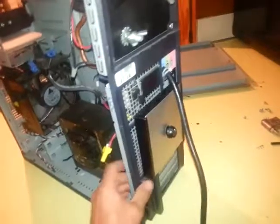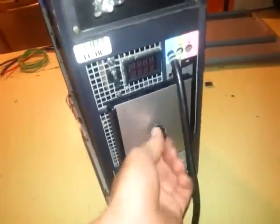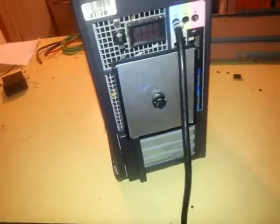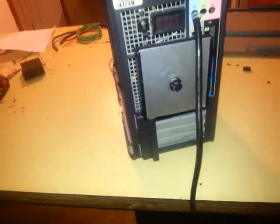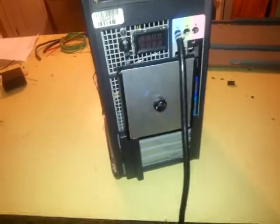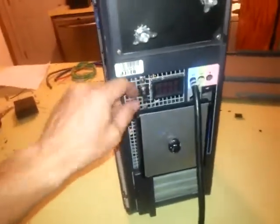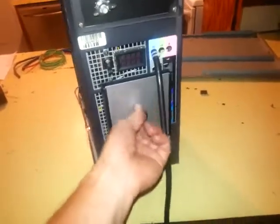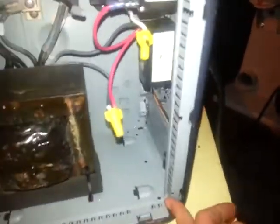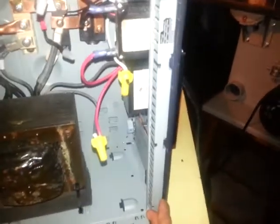This right here is the on/off switch that I've had for over 22 years. I don't know where I got it from. All I know is that it contains a couple of triac elements meant as an industrial motor speed control, or fan control for 115 volts. The lowest range here — I forgot that as soon as you turn it on it's instant high — so it's a good thing I installed the on/off switch, which also doubles as the circuit breaker. This is a KB Electronics KB WC-115, rated for anything up to 115 volts — probably 130 is okay, just because utility voltage changes — and up to 15 amps.